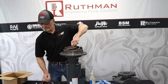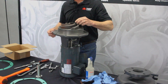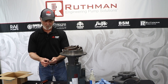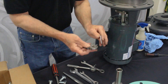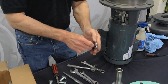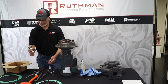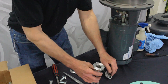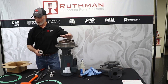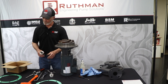If this were a stainless pump, the sleeve is going to look different — it has an O-ring groove in it. The reason we do that is so you can use a cold-rolled shaft with a stainless pump. You would take the washer, put this Teflon O-ring in there, then it goes on with a stainless bolt, which would seal in that groove. This sleeve also has an O-ring. It's longer and the impeller is shorter, so one won't replace the other — you have to be specific for the pump serial number that you have.